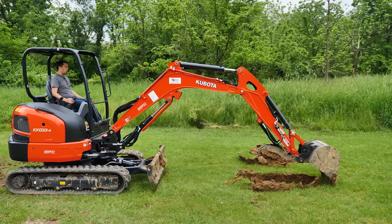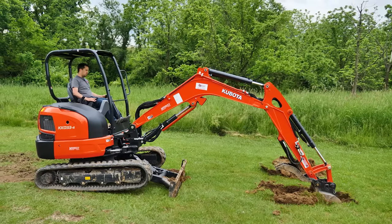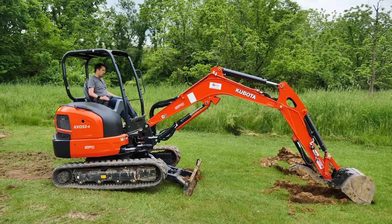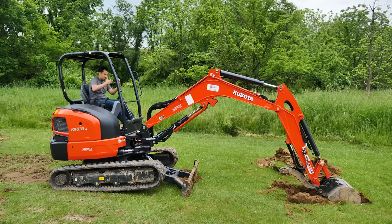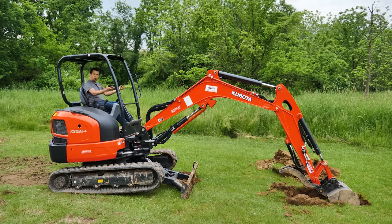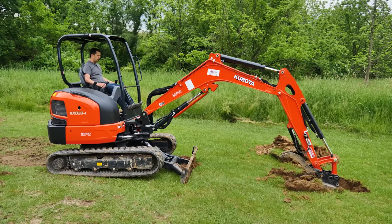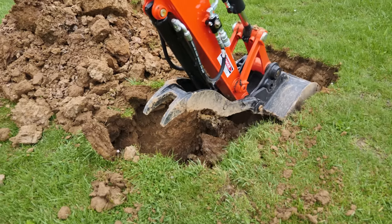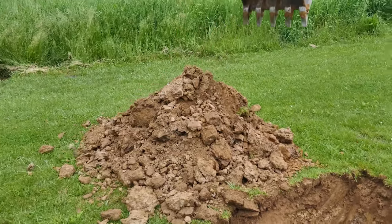The technique that you want to use when you're digging a hole is to put the bucket teeth down into the ground and then curl that bucket shut in order to fill it with spoils or dirt. This small pivot — that rotation of your bucket — is where the machine has its power. If you go down into your hole and try to use one of the other bucket functions to pull back towards yourself, say you sink the teeth in there and then use the right-hand stick to pull back and try to bring the dipper back into the machine, you can't move — you don't have very much force. If you think of the physics of what's happening there, that long arm doesn't have a whole lot of power — it's overcoming the huge length of that boom. But in that same position, I can just curl my bucket in and with no trouble at all I can break out that hard clay soil and bring it right over to the side. So you always want to be using that bucket curl circuit in order to break that soil out, and then the other functions of the excavator to crane the spoils out to the side and place them into your pile.